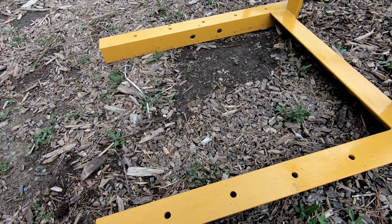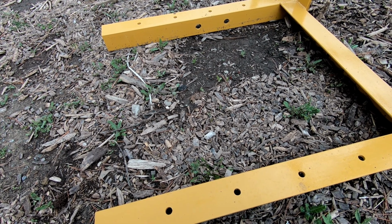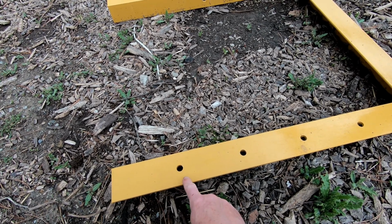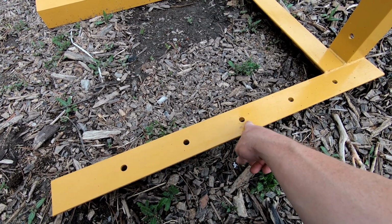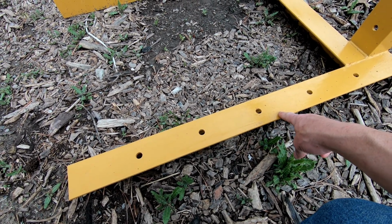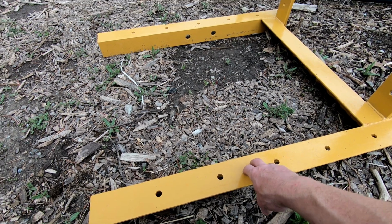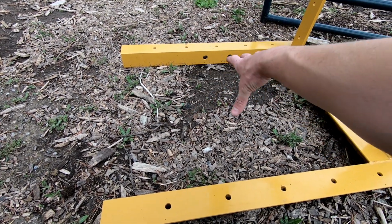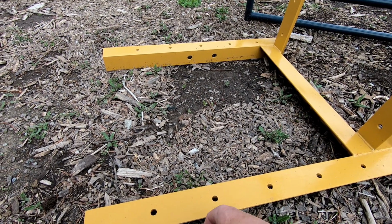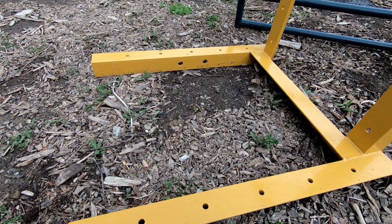I'm kind of using what was available that I had around, collecting scrap metal and various other pieces of metal to do that. For another project, I'd bought some 1/8 inch, 1/4 inch thick plate of steel. I'll use that to bridge here, and I can access these 3 holes. Then I'm going to use some angle iron to go across here, and in the middle I'm going to make a kind of landing where the tube can weld up to and the wire can sit. So that's the first step here.